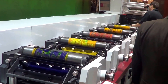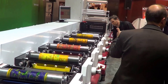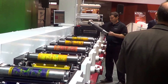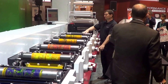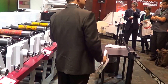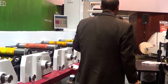Darren is going to take an ink tray that normally would have the varnish in it — it's got the metering roll in it also. He puts it in. Next, he takes his anilox roll and doctor blade assembly. As soon as he locks it in the mechanism — bam! He pulls that. That's the load and lock mechanism. There's no further adjustment necessary between that doctor blade and the anilox. He's now loading a print cylinder. You can take any size repeat cylinder, simply set it on top of that print station, and it locks in. This is a P3, which is an entry-level press. Even though the cylinder is locked in, Darren still has an indexing feature — he can rotate it 360 degrees, get it to the right start position, and he's ready to go.